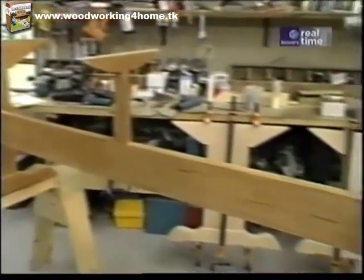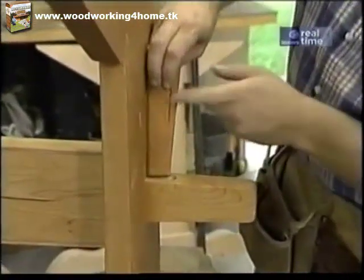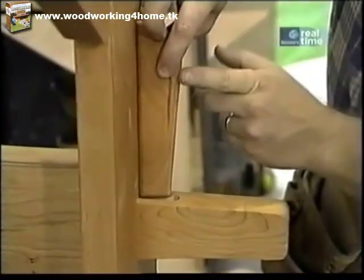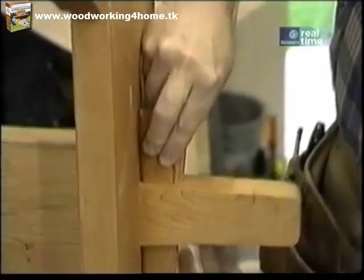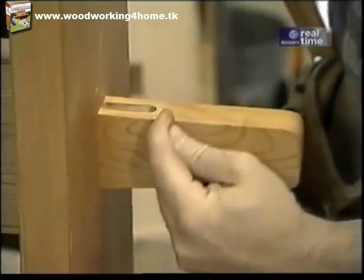The trestle assembly is held together by means of wedges on either end. Note that it's straight on one side and tapered on this side — that's so it'll wedge in there tightly. It also means that I'm going to have to cut the mortise at a taper, at that five-degree taper. So I'll do that over on the drill press where I've been doing all the other mortising,